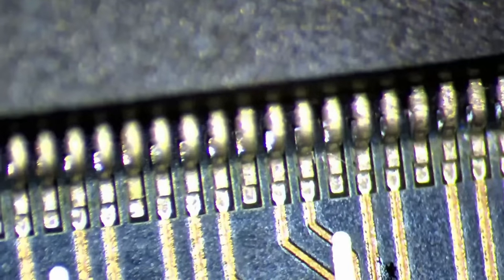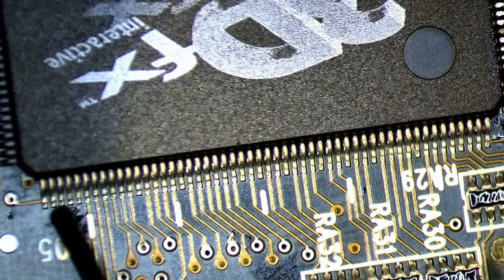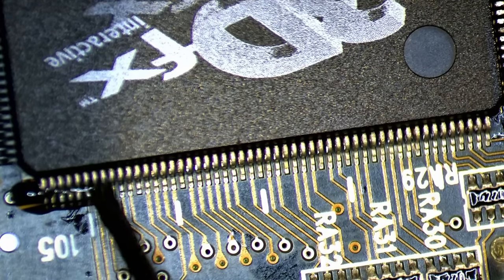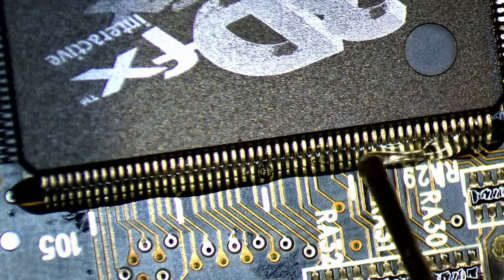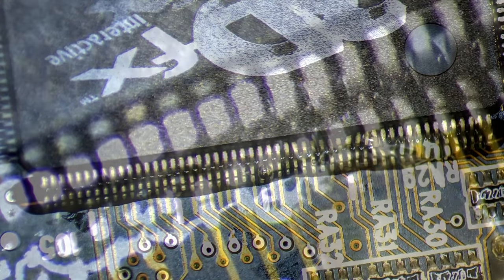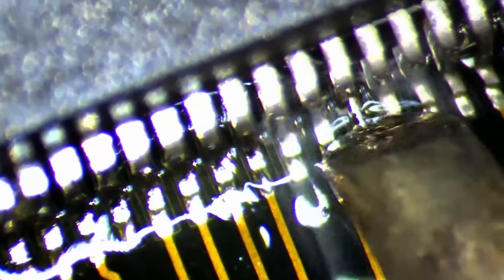As you can see here, the solder on those pins looks dull. My other Voodoo II cards from Diamond are of similar age, and the solder on those looks much better. Maybe Creative tried to save some money by using low quality solder, but it could also be related to how this particular card was stored. I only have this one card from Creative and cannot compare it to another one, but I am curious if you have one of those cards with the same issue on the solder joints. Whatever the reason, it deserves a second chance to render Glide titles again. Therefore, I will do my very best to reflow all solder connections and hopefully restore the full functionality of this Creative Technology 3D Blaster Voodoo II.